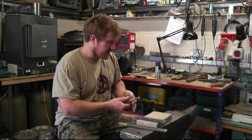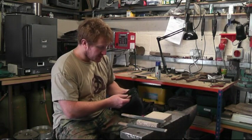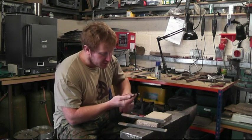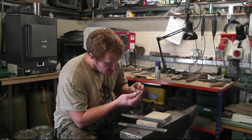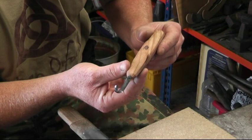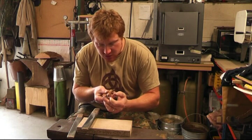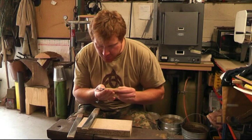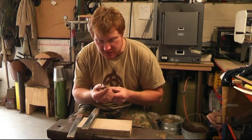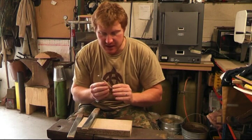A few strokes on each side. And then we'll put that down, just get a simple bit of cloth, being very careful when you do this that it doesn't cut through your cloth and into your fingers, just wiping it away from the cutting edge. Just wiping off any of that honing paste so we can have a look at our nice shiny bevel and ensure that we've got no flat spots. So we've checked the edge, I can't see any light or any flat spots on the tool, I can not see any burr hanging on there. If you do see any flat spots, you could go through the whole sequence again until you've got that cutting edge how you want it, but the main thing is not to round that bevel and to keep stropping it until you get rid of that burr.